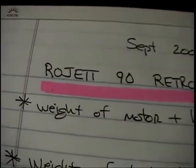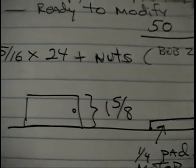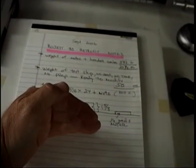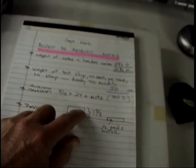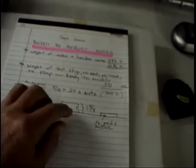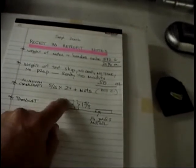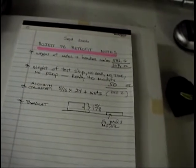Now, because I'm recording all these notes, the little things like the tank shims, now I'll know, and I'll measure it with a micrometer. When I get it exactly right, I'll make a final note, and then the next tank that goes in, hopefully, or another setup, will know from the engine pads to the tank center line. And Frank McMillan had a good way of doing this. He made a little, I don't know what you would call it, a micrometer setting of this tube to where the engine pads were, and then he put another tank in, and he pretty much got it right off the bat. We may be doing something similar to that, make a little gauge of how high this tube should be off of the mounts. That might be a good thing to make.